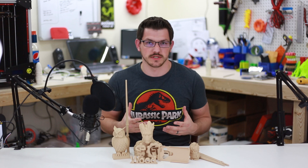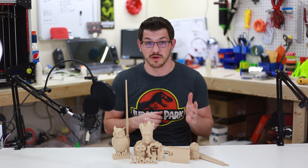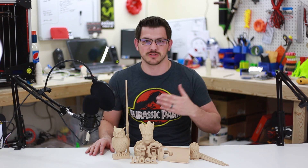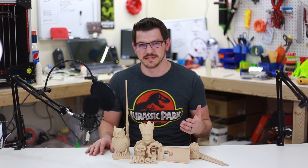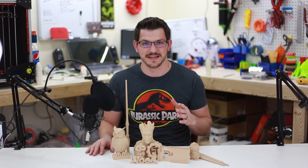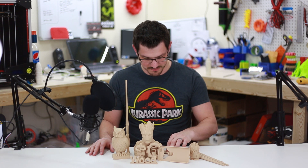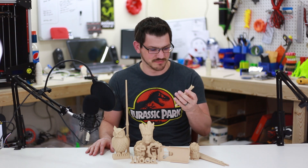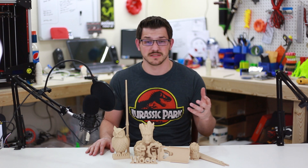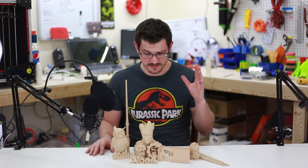Welcome back. My initial thoughts — I'm very disappointed with this filament. It prints beautifully and so smoothly, anywhere between 185 and 215 degrees, with no problems with stringing. I tried temperature layering as you can do with wood filament, but that's where the disappointment starts: there is such a high plastic content that it doesn't really act or feel like wood filament. I'm thinking this is more like 85-15% or 90-10%, with only 10% being wood content — or they're just calling it wood because it has some particles in it and prints at a low temp.